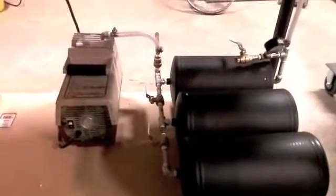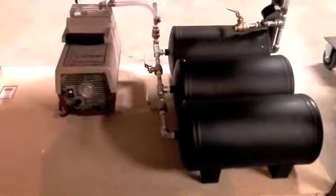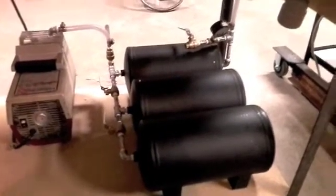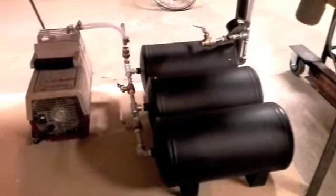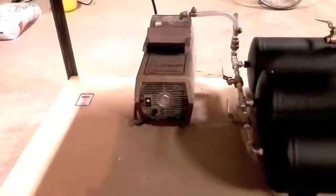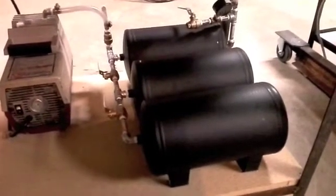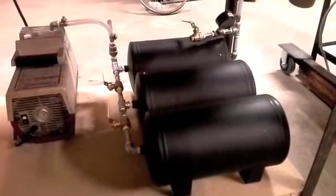I have that going in the side here, and we'll go around the back and I'll show you what's underneath. Underneath here I've got this setup, which I built myself. This consists of three two-gallon tanks, all divisible by two-gallon increments the way I have it piped up, so I have a total of six gallons of vacuum on hand. I'm not sure if that's going to be enough, but I think that's pretty good to start with. I also have this little half-horsepower air compressor, which I'm using as a vacuum pump. It doesn't work perfectly as a vacuum pump — it won't draw a full vacuum — but it will draw about 25 inches of mercury, which is not bad.